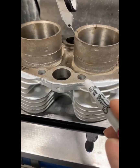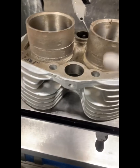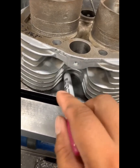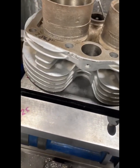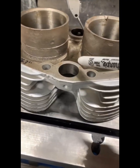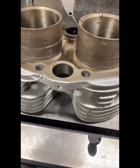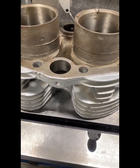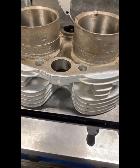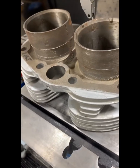The reason why I want to bore the cylinder barrel with the base gasket facing up is because there's simply more clearance here. If I were to do it the other way around there's tighter clearance and my boring bar would have to be so far extended that I'd probably get chatter. In this orientation I should have a short boring bar that'll be very rigid with less chatter. I also have more control and might be able to get a bore gauge in this area here.